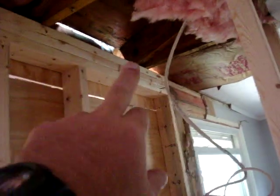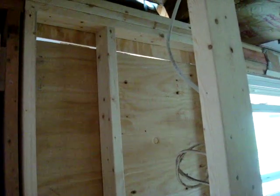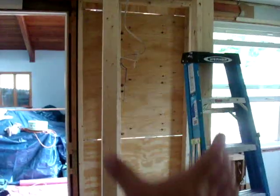This is called the top plate, and if you look closely, you'll notice that my top plate is a half an inch higher than their top plate. The reason is a bit bizarre — the modular company actually set the trusses on top of the drywalled roof. The drywall actually sits on top of the original top plate and then they dropped the trusses on. I guess it was approved — a little unusual, since normally you don't use drywall as a load-bearing member. So since this entire section of load-bearing wall is being rebuilt, I just brought the top plate right up to the trusses.